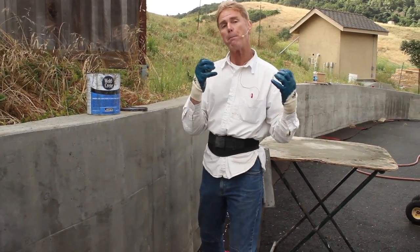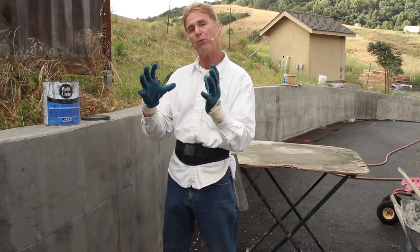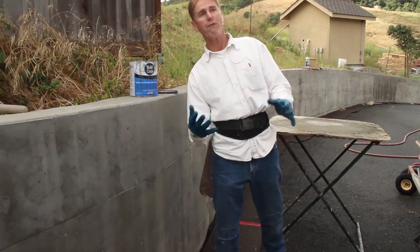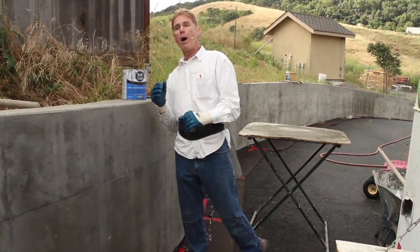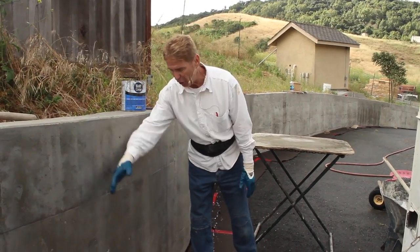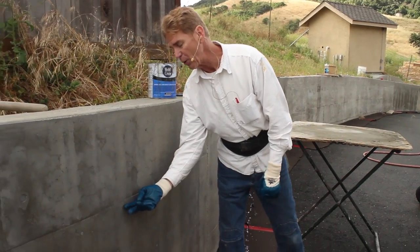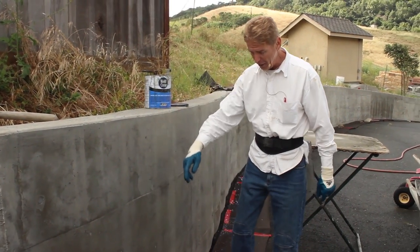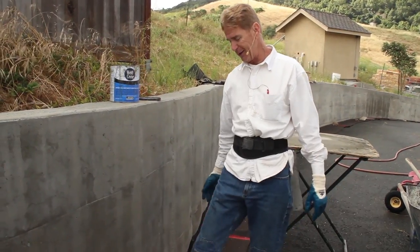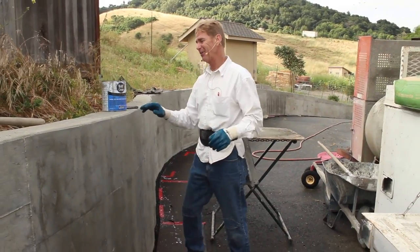we want to make it more porous so that the next finish, which we're mixing right now, absorbs by suction. And right here, where they put oil on the form boards in order for the concrete not to adhere, we put a little bit of a bonding agent over that because we've got to fill this up and make it really adhere well. Anyhow, hey, spider. Okay, getting off of that. Get carried away, guys.